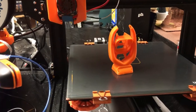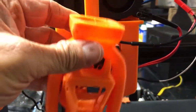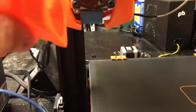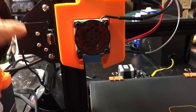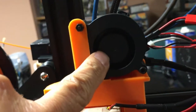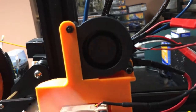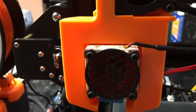I haven't looked back, but I've been modding it constantly — I got into that part of the hobby too. This new Fang duct is going to replace the old one. I've been having hard times with PLA because the old duct puts out too much air. This new one did not click once. I was getting extrusion clogs and under-extrusion constantly. When I unplugged that fan, the clicking stopped immediately — but you still need cooling for PLA layers.